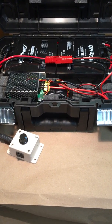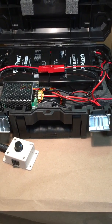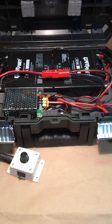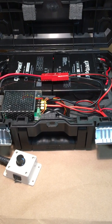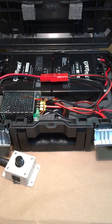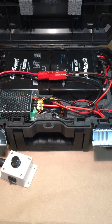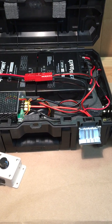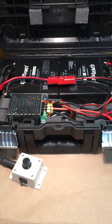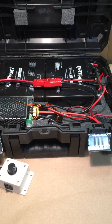So that's the reason that I decided to go with 18, because that was actually the smallest one I could find. It's made by Water Snake from Australia, I believe, but they do sell it under a different name here in the US. It's sold under, I believe, Sevylor and also Coleman for some reason. I don't know why, but Coleman has it under their name also. It's called a T18, I believe, and it's Water Snake. So if you want to Google it and check it out, just Google 18-pound trolling motor. The reason I went with that is that it only uses 10 amps. A 30-pound trolling motor uses, I believe, 30 amps.